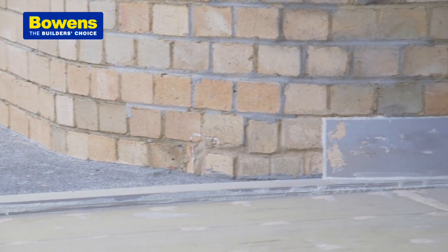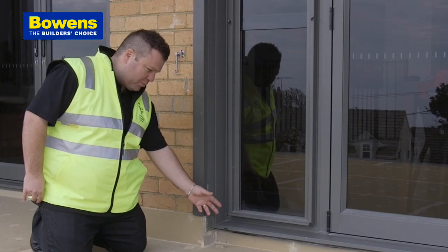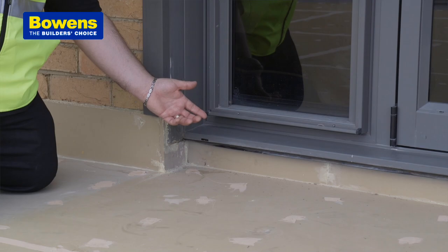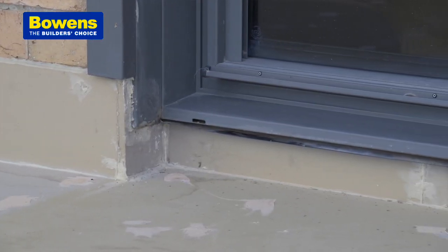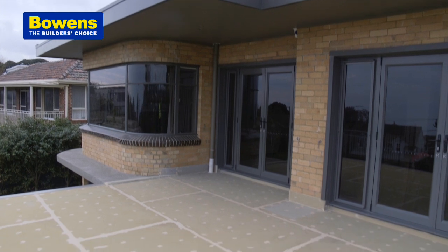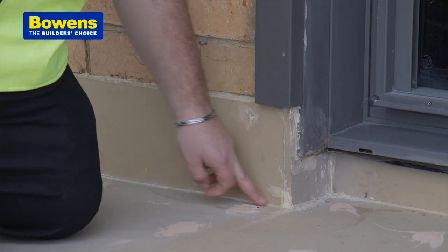In this application they've used the Multi-Panel as a wall and floor junction. Traditionally you'd use a metal flashing, but Multi-Panel being the same material, the upstand from the flooring component with the polyurethane adhesive almost fuses the panels together and becomes one actual panel. You've got a complete waterproof seal from the wall and the floor junction.